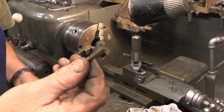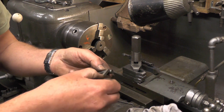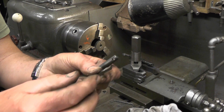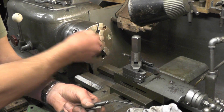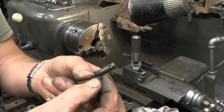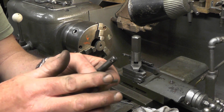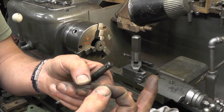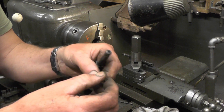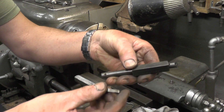What I've done — I've got a piece of tool steel, 3/16" square tool steel, which slots into my boring bar. I've ground a 1/8" wide — it's not actually this one, it's the one that's in the lathe now — but just to show you, I've ground it 1/8" wide at the front. We'll call it like a parting tool — 1/8" wide at the front, same clearance as you'd put on a parting tool. And you're going to put that in your boring bar in the unconventional way — sideways.